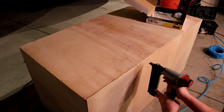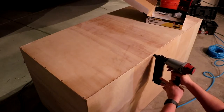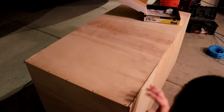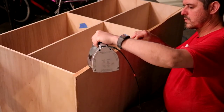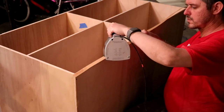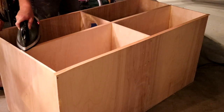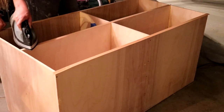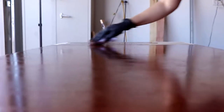Just put the back back on there — that's again about a 2x4 piece of 1x8 birch plywood. And then we're just going to go ahead and iron some veneer on to give a nice, clean, smooth look all the way around. Since we're going to be staining this, this is actually all wood birch veneer, so that keeps the wood looking nice and consistent.